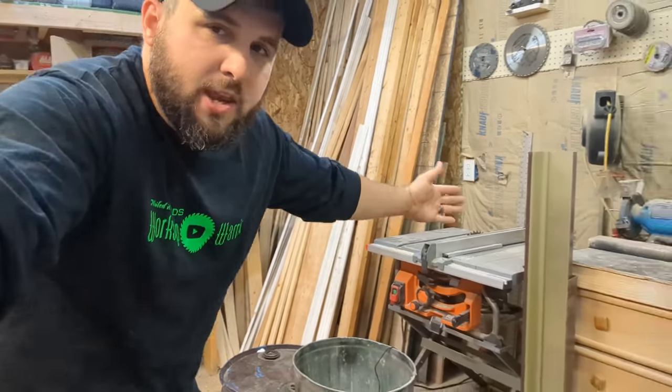I'm going to show you just a couple of small things I've done. Under the workbench lip, I have a shelf strictly for tape measures, and right here I have slots for all my files and chisels. These stay on because I have recessed magnets in them — I was having problems with them falling off when I was pounding on the workbench, so I got some earth magnets from Harbor Freight, recessed them, and they work great. And I also have another drawer right here.